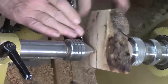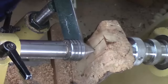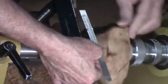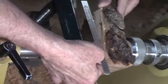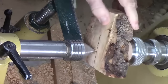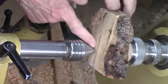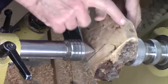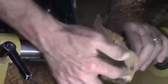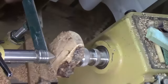It's got just a bit of a concave to it — not a lot, but just a bit — so it'll lift off the table when it rests here. You can see that looks good. I've got a little bit of a raised area here; I'm going to have to take that off with the hand sander or touch it against the belt sander. Now what I want to do is use a texturing burr to get some striations here.